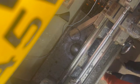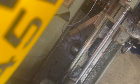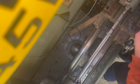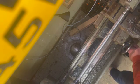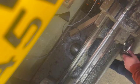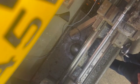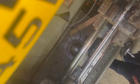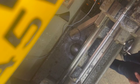So the wheel's going to sit up to where I've marked it, and anything beyond that point will be, I think it was an M10 by 1.5mm thread that I tacked on the end of it, as you are going to see now. So just going to go through the process, just double checking my measurements, and then going through the process of turning the end of that rod down up into the black line, as you can see there, just so that we get it to the right size to cut that M10 thread.